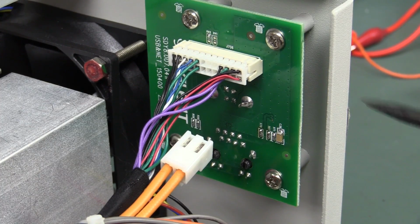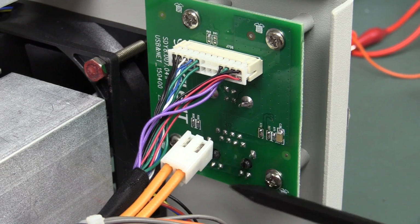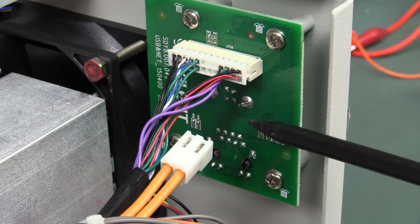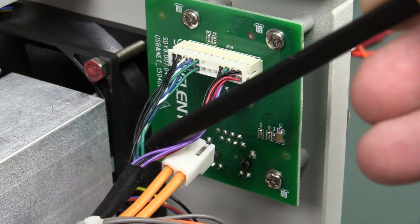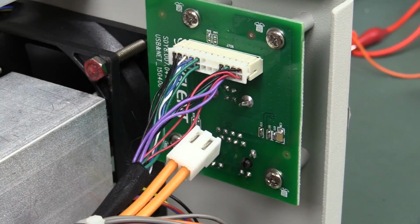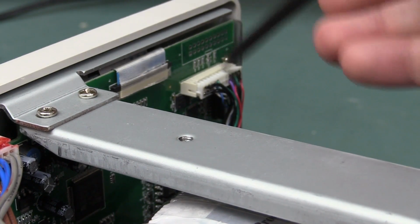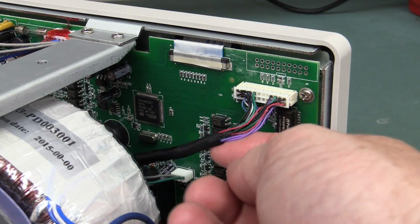One interesting thing here is the Ethernet and USB board. Here's the Ethernet connector down here, and you'll notice that the driver's not on that board. They're actually going through this unshielded multi-way cable here, and they've got a nice sleeve on it and everything, and that goes all the way over to the front panel where our Ethernet transceiver is down there. So yeah, see, there's our output transformers. So once again, they're getting away with that.